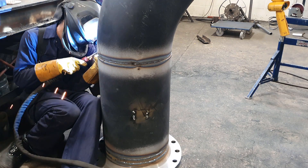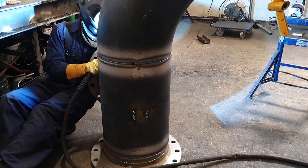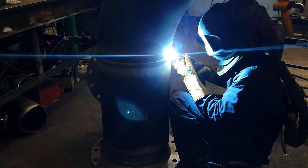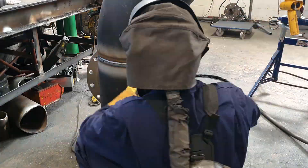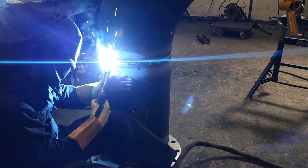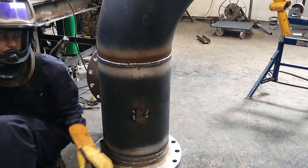My root's in. This was such an uncomfortable position, but I wanted to keep most of the weight down on the ground so I didn't have to worry about it falling over. Now I'm filling. The alignment of the fittings wasn't perfect — the elbow was bigger than the tee, so there was an overhang. I ground that down so I could put my next run in. Now it's done, I can go around it and cap it off with the third run.